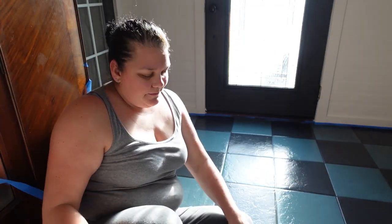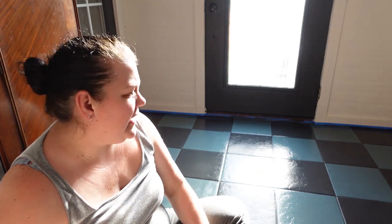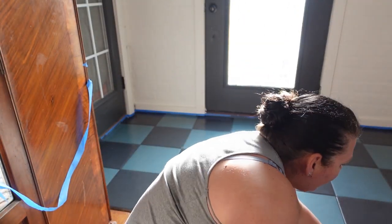That is one coat down. The frustration is that it doesn't matter how many times you clean or vacuum — if you have cats, the fur is going to be floating around in the air constantly. My roller went from being clean to being covered in cat hair even though I just washed the floor right before. So it is not going to be perfect. I'm going to put the timer on for two hours, then come back, sand down any spots with 220 grit sandpaper, and go from there with the second coat — just keep going until I get four coats on.